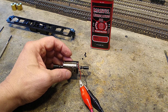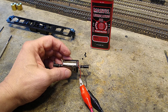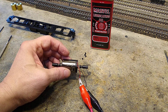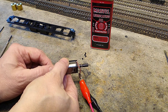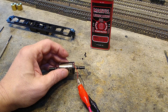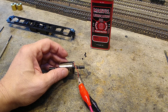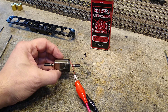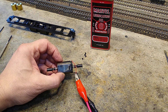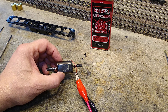See how low he's going to go? 1.95 volts, still turning. 1.2 volts, turning. Let's try a little stall test — stall him at 15, 16 volts. 0.5, 0.7 — we just went over 1 amp. This is about a 1 amp stall. Good enough for this motor. We're going to keep him like it is, and we'll see what happens next. We're going to look at those trucks and see what we can learn from them.